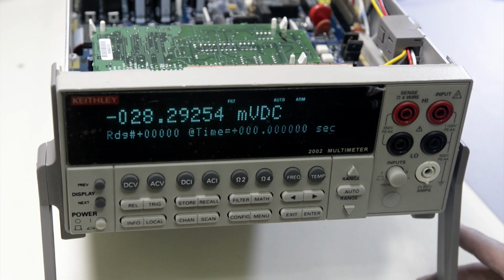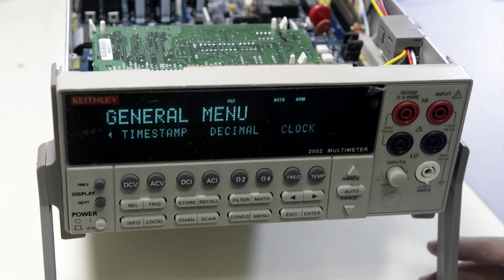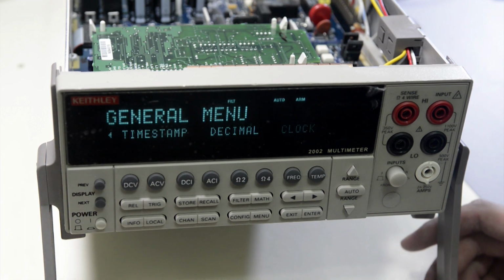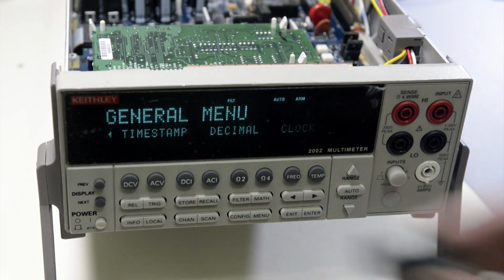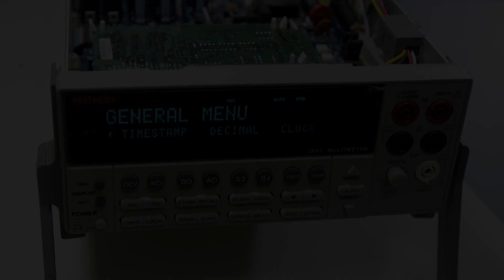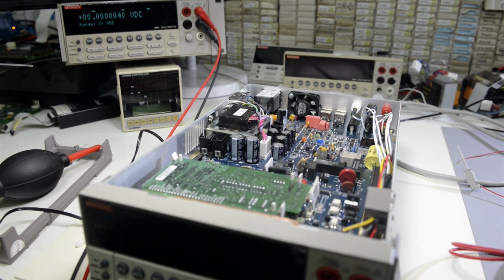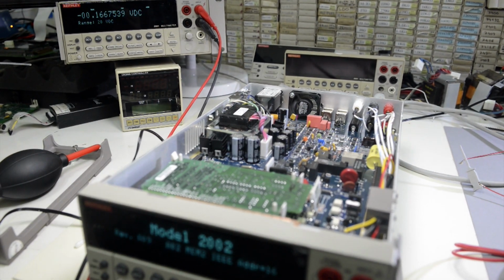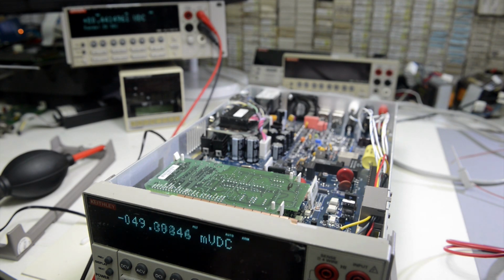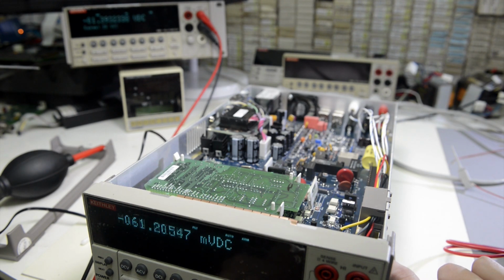Yep, they are there. So the memory 2 option works. So the DS1245 is just a memory, and probably they need memory together with the RTC clock inside. If we look at the original chip, it actually has a small IC, which is the RTC. Let's check that everything is working fine. I'll leave this message for now because I don't have the necessary Dallas ROM with RTC, so I'll buy that later. And let's run self-diagnostics.